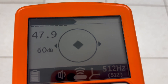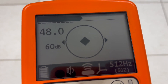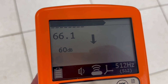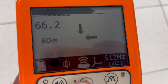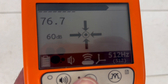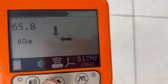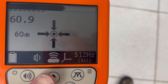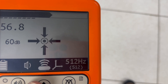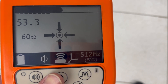In addition, we recommend using two other functions — find the null spots. The null spots are where the wave actually goes back underground when it propagates from the transmitter. So if I go in this direction and follow the arrows, there's a null spot. A null spot looks like a bullseye, or a dot with a circle around it and four arrows pointing in. You mark that, then go to the other side of your peak, follow the arrows, and there's the other null spot. Finding the null spots and the peak and marking those, you'll notice that they form a straight line, and the null spots are equidistant away from the peak. That's important because this is the way the wave propagates above ground, and you can use that to your advantage.